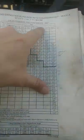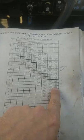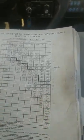So this definitely isn't the right load chart for it, but if this was your load chart, you would definitely want to cover, I need to go 80 feet and I got my boom all the way out, how much can I pick up? And so you pull this down and then you go over 80 feet and you can pick up 9,380 pounds. All right. What's going to come off of that is the weight of your blocks, your balls. If you happen to be picking up from the main and you have an extension sticking out, that's drastically going to reduce how much you can pick up.